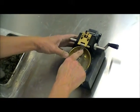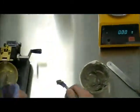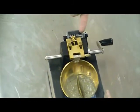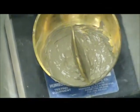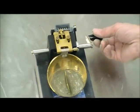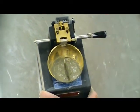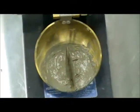We have cut a groove and we can see through to the metal. The idea here is we're going to zero the counter and start counting the number of revolutions that it takes for that gap to close for a distance of half an inch. The procedure is to turn it at approximately two revolutions per second, steady, and the counter is going to take care of the numbers. We're starting to see the gap closing right there. We have closed the gap by about half an inch — that's the distance where the bottom of that groove has closed.